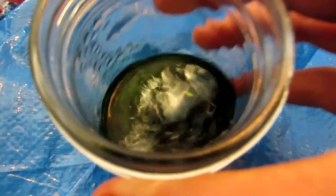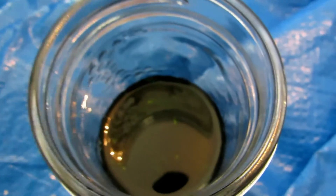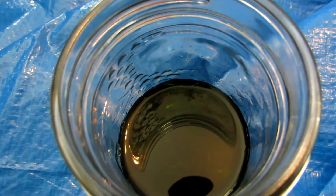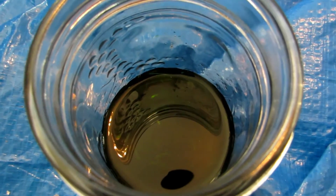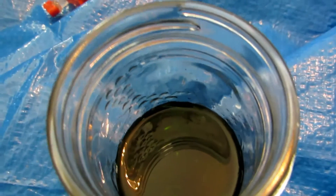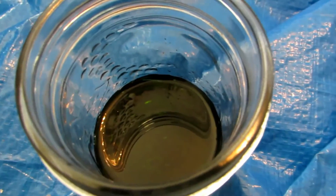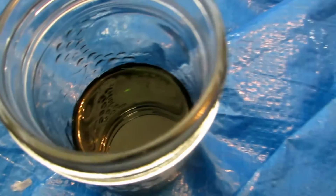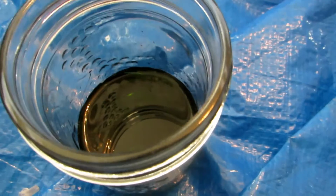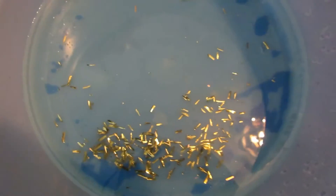It's been just over a day now and the gold has mostly dissolved off. If you shake this around you can see the little gold foils floating in the solution — they'll sink to the bottom because gold is a lot heavier than water. What we're going to do is let them settle, pour off as much solution as we can, and then add the whole thing to a big bucket of water. In that bucket we'll be able to pick out all the circuit chips but leave behind the gold foils.